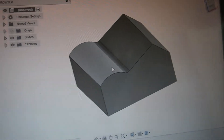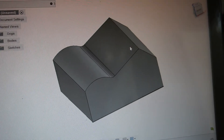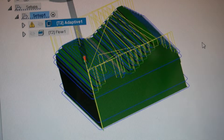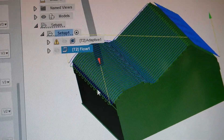This is the part I've designed — super basic, nothing too crazy. We're going to be doing an adaptive roughing strategy on this to start, and then I'm gonna do just a basic flow toolpath to go down through here. We'll do some adaptive, we'll do some flow, and we'll just see the difference between the 100, the 200, the 300, and the 400. I'm gonna hit cycle start and we're gonna run it.